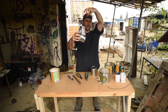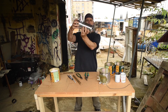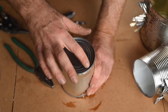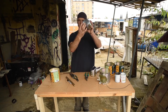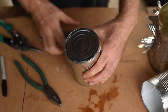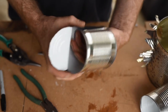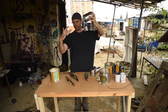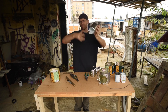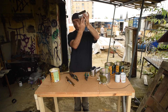That's the back half of the burn tube and the first third of the riser. Your wood's going to be in here, your secondary combustion in here. Now make the other half of the burn tube — take your can opener and cut around two-thirds, leaving about a centimeter each side of connected metal, then cut out the rest, so you have a large cut and a small cut. Then carefully reach in and bend that top flap out and down. That creates a little shelf for setting your wood on — a raised lip that grabs onto the wood so it can't slide out, and lifts the wood up off the bottom of the tube so it can be surrounded by flame and air and burn more effectively. The smaller cut is to feed oxygen and air into the coals that collect in the bottom of the tube.